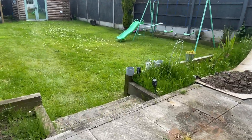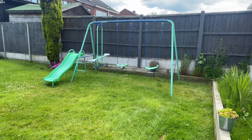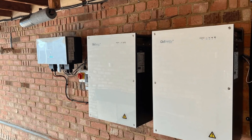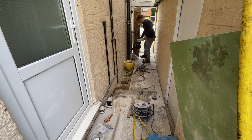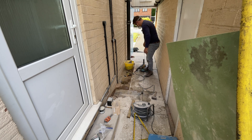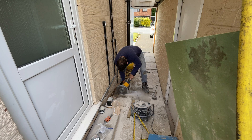What about if we mounted it to the garage wall on its side? Out of the way, and it would give me some garage space back. Well, that wall is a single-skin brick wall and I don't trust that it would take the weight. Originally, I was thinking of hanging this battery on a wall like traditional battery storage would, but given its weight, it's probably best to let the weight be taken through the ground. So that leaves me with a plan I shared in the last video — to mount it on the space that I have on the wall of my house. I mean building a concrete base, providing some footings for the battery to sit on, and then retaining it to the wall so it can't move.